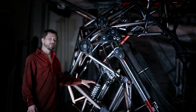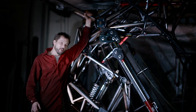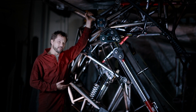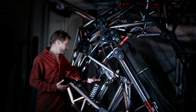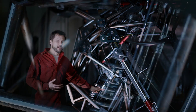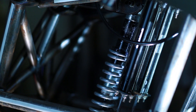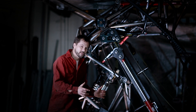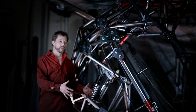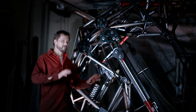But it's the suspension that was the real innovation here. The suspension had to be custom engineered because no one's ever really built suspension for a giant walking machine before. We have an automotive damper and coil spring, but we also have a couple of air springs which are controlled by the pilot in real time. They can automatically and instantly change the impact resistance and the rebound force of the springs, which is something that pilots will have to learn to adapt to different terrain and different running speeds.